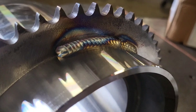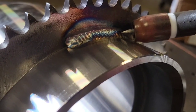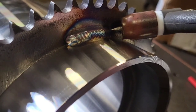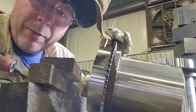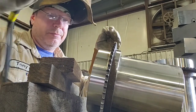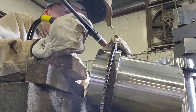I'm going to show you how I'm holding that torch — at this angle with that amount of stick-out, and I've got the foot pedal all the way down. I'm not pulsing or anything; I'm just moving it step, step, step. Always get comfortable and do a dry run first. Proper preparation prevents poor performance. Take your time — if somebody's rushing you, find another job.